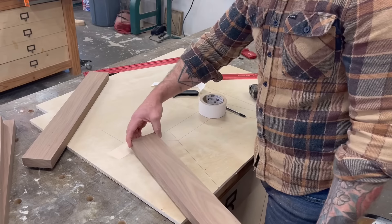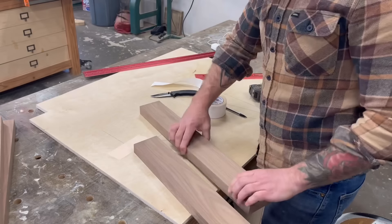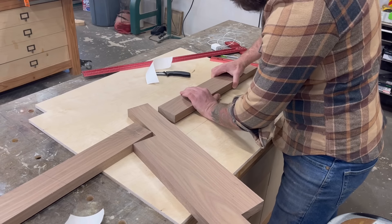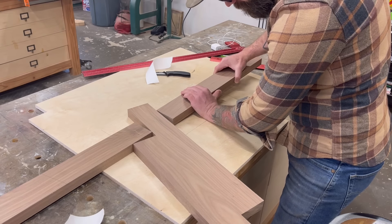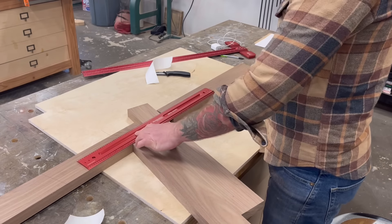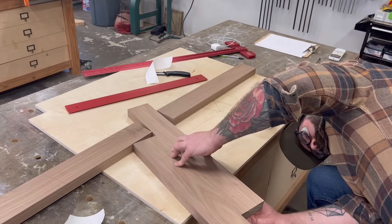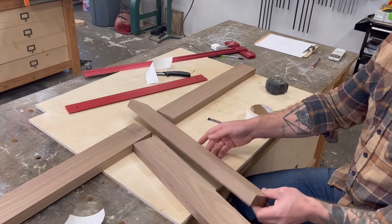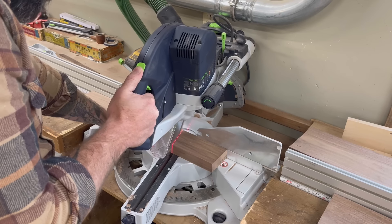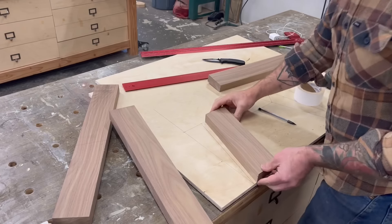It's just as simple as cutting them to that shape and hooking them together. First, we've got to figure out how to cut them to the right shape. To do this, I use double-sided tape. I tape some blocks down along the lines of my leg and the top of my box — this will give me all the angles I need. I slap my actual leg piece in there so it's held firm against those pieces, and using a straight edge, I trace a line along the top. This gives me the exact angle and position I need to cut the top of the leg. Then I do the same thing on the bottom. So all I need to do is go over to the chop saw, match that angle with my blade and slice them down. In no time, I have the beginning of a nice angled tapered leg.